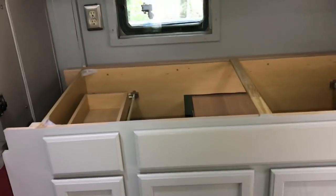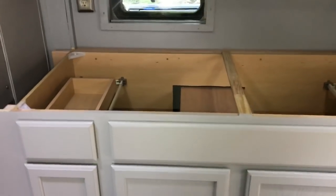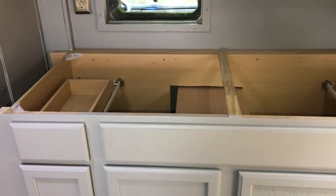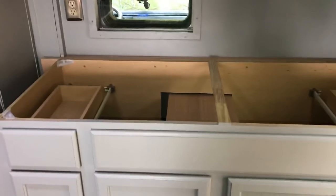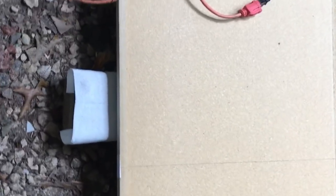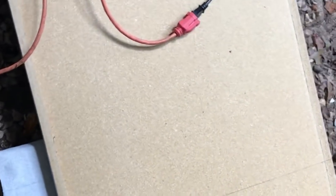What I have to do very, very carefully is make sure I cut it exactly straight. Otherwise, if it's a wedge shape, it'll bind up and it won't come out, or there'll be a big gap. I find myself yet again at the place where I'm destroying something expensive. This isn't a very expensive countertop, so it can be replaced, but I always hate cutting up something perfectly good just to try something new.